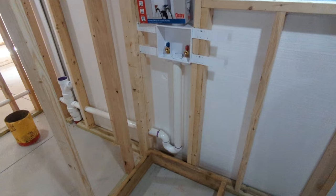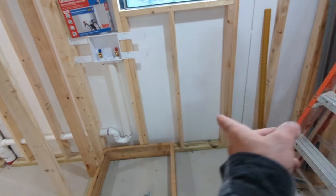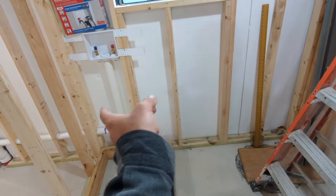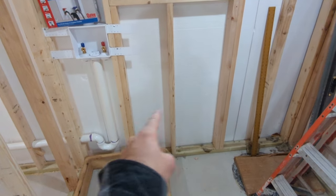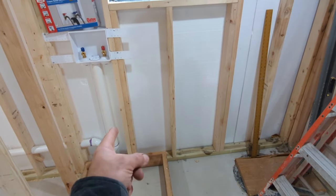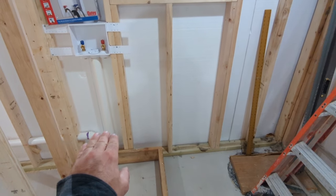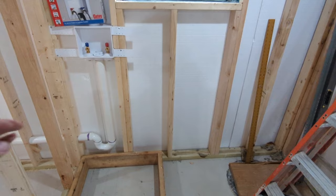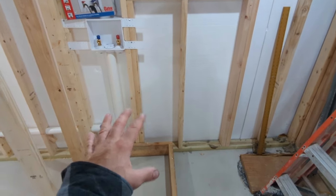We've also got to get the slop sink into the plumbing. But we are unable to go past or around or behind this, and you can't take wet draining into this atmospheric vent, because if you think about it, you'll have water all the time standing in this trap, which is by design so that you don't get sewer gas up into the living space, which is explosive and stinky.